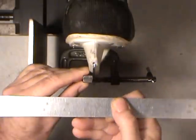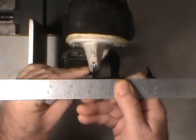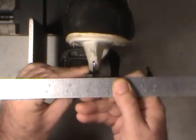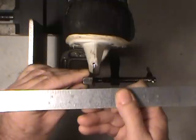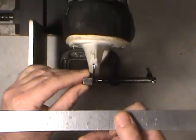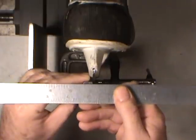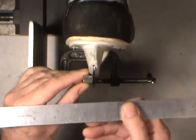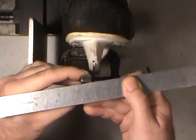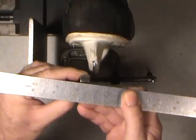And like I say, when I have the scale on the two points of the sharp edges of the blade after it's sharpened, you can even check it that way if someone has sharpened skates for you. Or you could get a little square, if you get one that fits in there without banging into the blade holder itself. But get this to touch down on both contacts, and then I shine a light from the back and make sure that when it comes up it's parallel, because if it's cocked this way or that way, then you know you've got a high edge or a low edge depending on which way it's leaning.